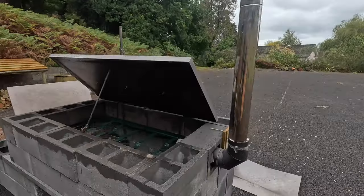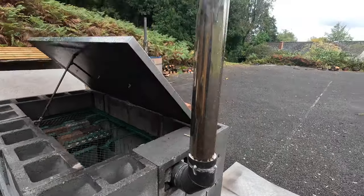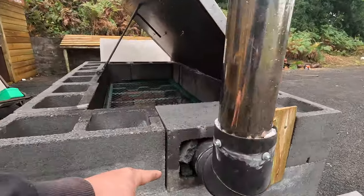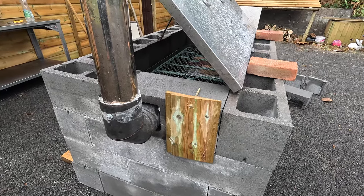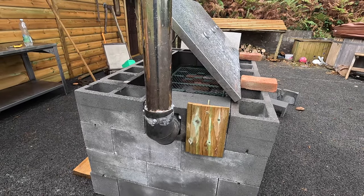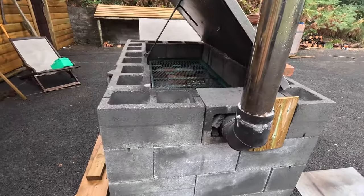So the rain has finally stopped. Just want to do a little update of where we are at. So we have mounted the 90 degree elbow to the chimney, or the flue. We need to block this off still. I'm thinking we could put another pipe that comes through so we can adjust the airflow, and on the end put a little swivelly cap so we can partially open and partially close. Again give us some control over temperatures. So that will be a nice little detail.